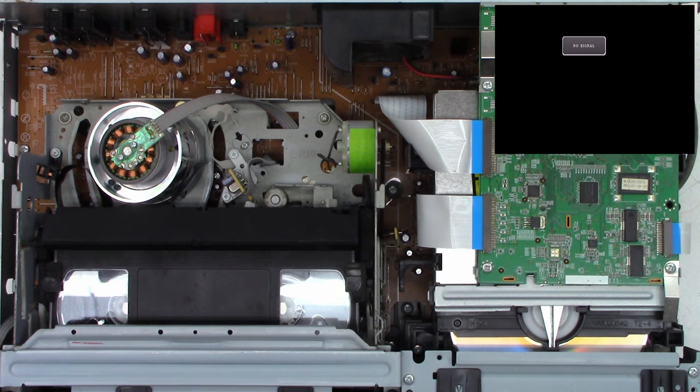So, other end of the cotton swab soaked with acetone, and this one is a little harder to get because it's down low. And I just want to clean the pulley. I don't know if you can see what I'm doing. I hope that you can. So I'm just basically wiping the groove with the cotton swab and rotating it with my other finger. Got a little bit of stuff out of there. Not too terribly bad. You can see a little contamination on the motor end.